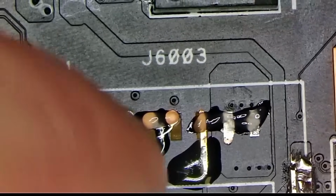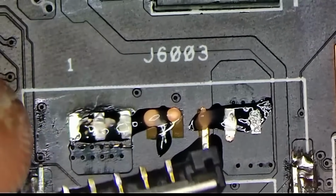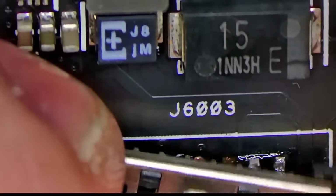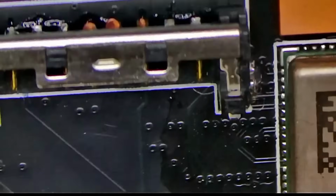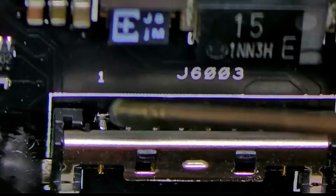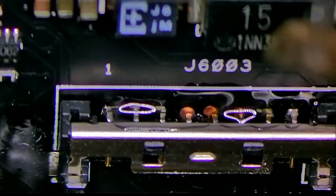and then we want to have a little bit of solder, well, maybe not. Actually, no. Actually, we can probably check that from the side. So let's go ahead and do that from the side, from an angle. It's probably going to be the best way to approach this. Let's see if I can accomplish that on camera. So the connector's going to go in here like that. And I just want to make sure that I got the ground corners here snapped in place, which I have. And so now we can actually see all of our connections, which is exactly what I want. So we can now solder these pins individually, one by one, and see if that helps.